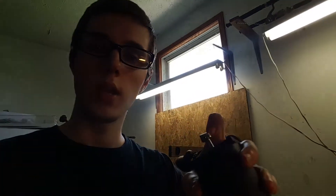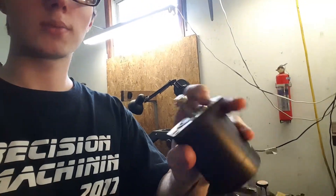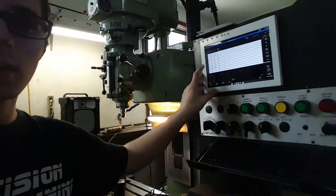If the driver for this little motor isn't analog, I'm gonna have to figure out some way around it or get a new servo motor — it's probably only 24 volt but I'll have to figure it out. I was getting shaking and the only way I could figure out how to fix it was not tuning it in LinuxCNC but tuning it on the board itself with the little knobs.